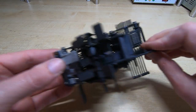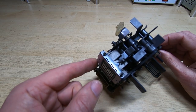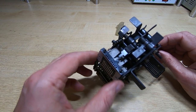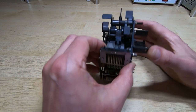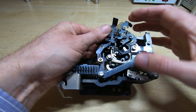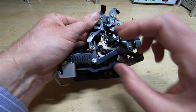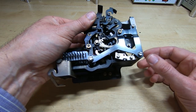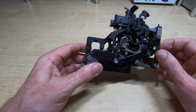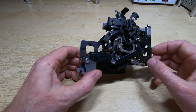I've given the punch a really good clean. I've removed the chad chute so I could look at the punch pins under a microscope, checking the condition of the ends of the pins to make sure they're in good order for punching the paper — and they all look fine. There's not a huge amount of wear; I don't think it's had massive use. However it was partially seized and wouldn't turn very freely, and the backspace key wouldn't rotate the drive sprockets, so I had to free that up. It's now turning reasonably freely, though it still needs cleaning and lubrication.